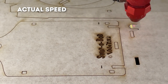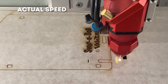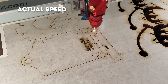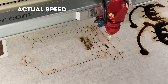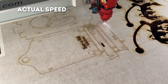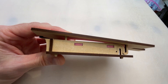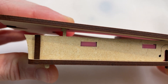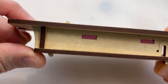We went back to the drawing board and I completely rethought things. I added really long arched spring clip tops, and on the bottom I just put a little hook catch — I realized the bottom sections didn't need any spring at all. I put all the spring in the top and gave them plenty of spring action with loops, which should give plenty of wiggle room when assembling at home. I'm happy to report the redesign was a success. The spring section clicked in — so satisfying, so secure. Let's cut the real deal.